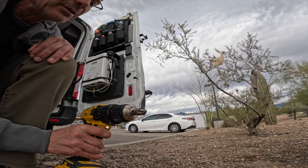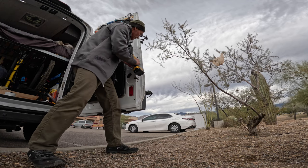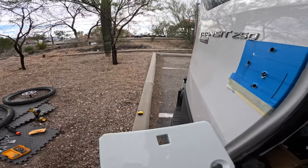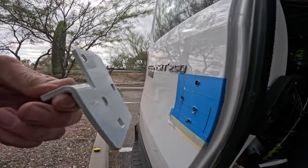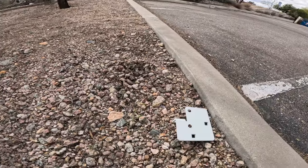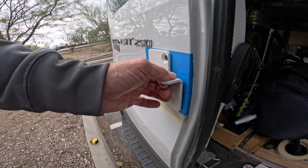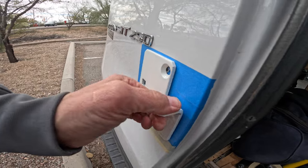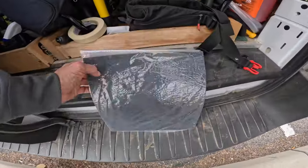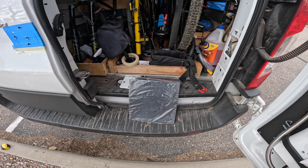I'll give some of these holes a very gentle little deburring. Another small issue I had — with the size of this thing, I really thought it'd be more like three inches and it's like four and a half, maybe. What I've decided to do is use this big sheet of rubber an eighth of an inch thick that I found in the Ace Hardware store. I'm going to back the entire locking plate with it and then thicken it up in the middle.